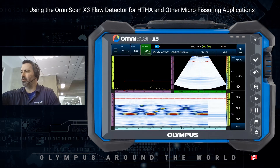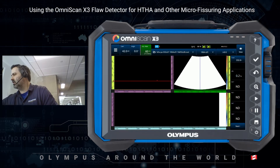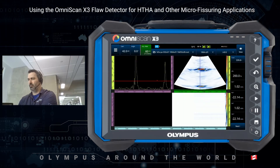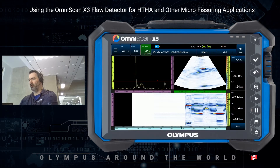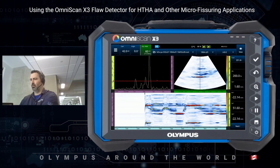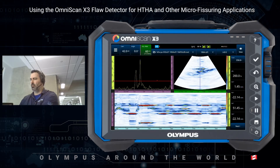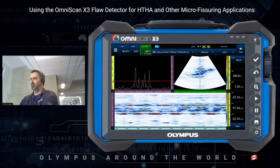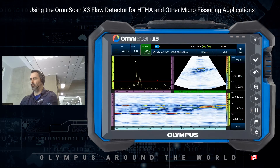So if I remove the 5L32 and move on to the 10 MHz 64-element probe instead — now if I position it in the same spot, I still have my back wall and blister, and now I'm able to detect it with much better resolution. Everything in between, all this cluster or colony, is much better resolved. Even close to the blister, we can still see it.